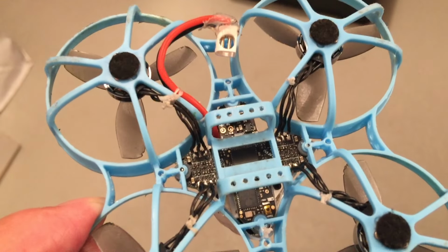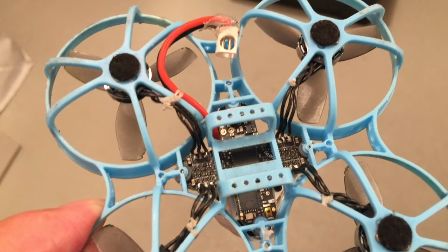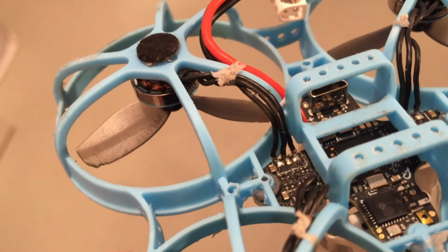The second best modification is to remove the motor plugs and solder the motor cables directly to the solder pads on the board. This way you can save a little bit of weight and also gain a little bit of efficiency and less voltage sag and so on, like with the AWG20 main cable. If you do this modification, you should leave on the little crimped metal piece on the motor cables to make the connection stronger.